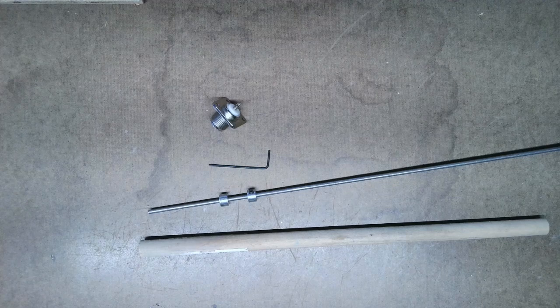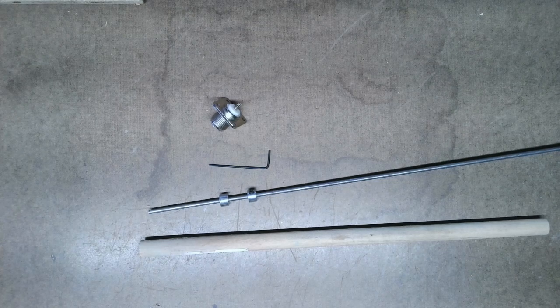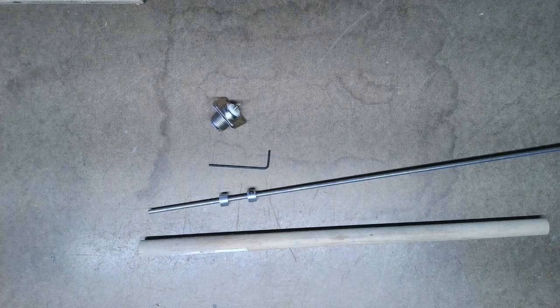From my past experience building adjustable antennas, when you start adding adjustments it does change the characteristics of the antenna. One proof of that — I was making a quarter wave antenna and by the time it was all said and done and tuned in, it ended up being three-quarter wave. The reason was the tubing and collars changing the antenna characteristics. My plan here — if it doesn't work out, I'm not really out anything because I can reuse these parts for another antenna build.